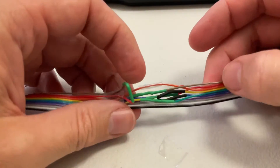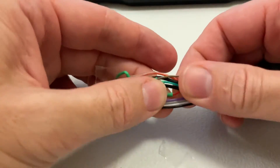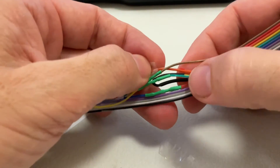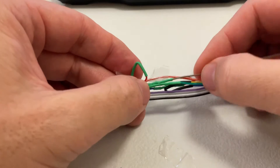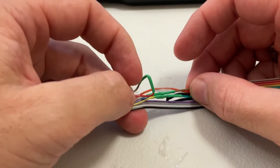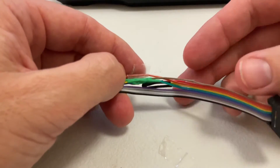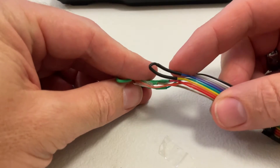What we want to do is separate those cables out. You don't need to separate the purple, grey, white and black, and out of the rest you won't be cutting the orange. You cut them, and on the display side you won't be using red and brown — they can be joined together or just left cut off. On the SKR Mini board side you won't be using the blue and yellow.